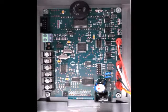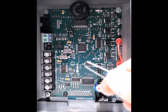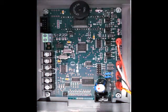Once we've got that done, we need to use a jumper wire. You can use a piece of wire, but the easiest thing we've found is just a small paper clip clipped in half, making a U-shaped link. Insert the paper clip between the two terminals that the thermocouple was just attached to — the positive and negative. Now we've got our jumper wire in there and we're ready to start the thermocouple bypass test. We need to go back to the front side of the controller.